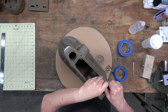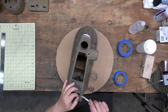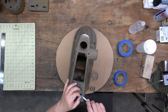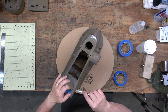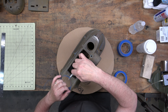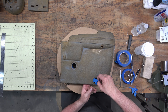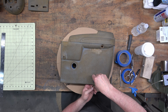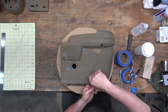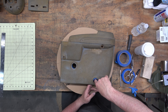On the head unit, there's a lot of bores and all of them have to get masked. Basically, we're going to mask everything that's either going to be bare metal, like the table surface or the bores in the head unit, or anything that's going to have oil placed on it because there's no reason for it to get paint. It's just cutting tape to fit these various bores, getting it to adhere in there, and then coming back with an X-Acto knife to clean that up.